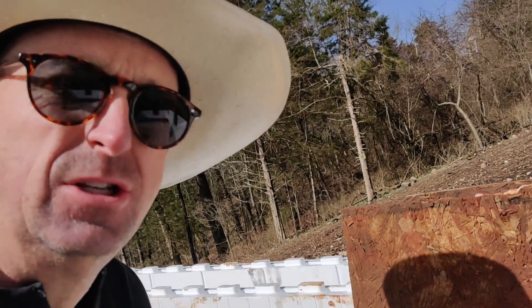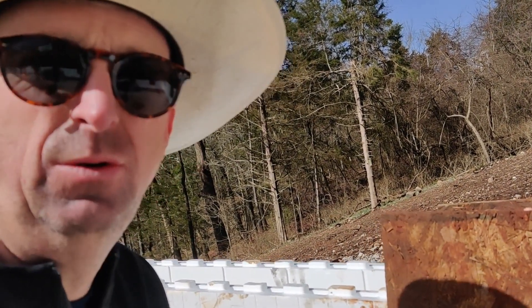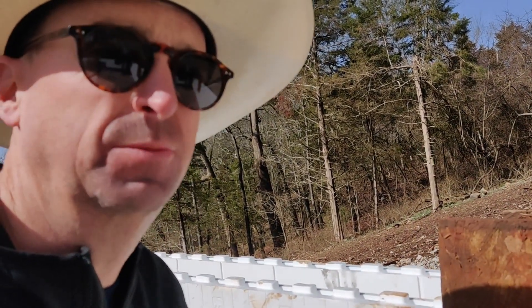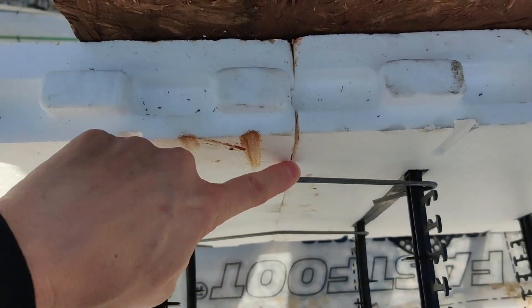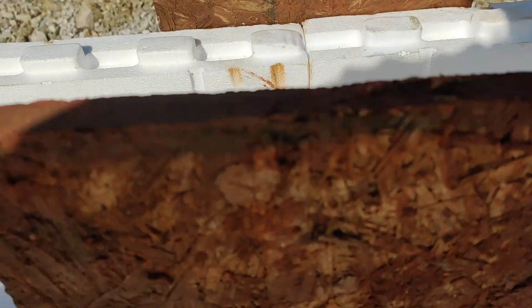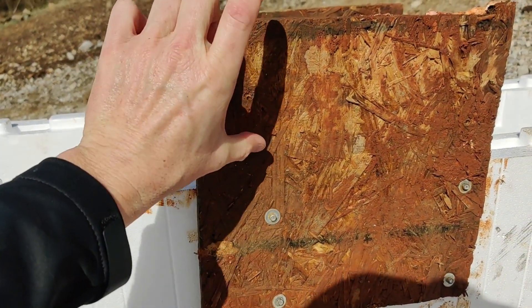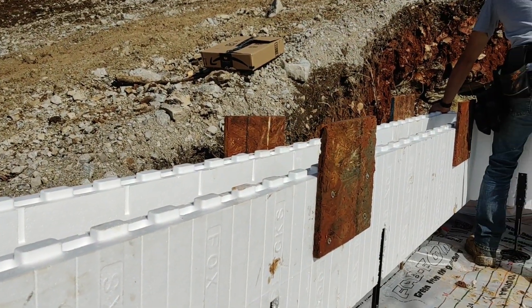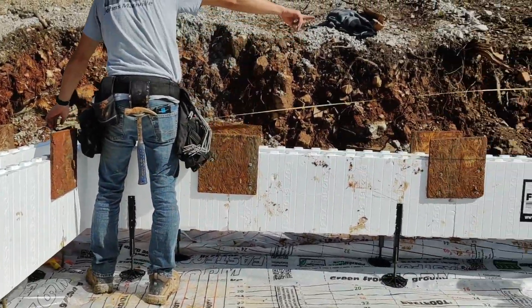You'll notice we're putting on these extra pieces of scrap wood — it's all by design. These guys add a little extra support all the way down at the bottom, because the amount of concrete and pressure is pretty great down here. We have this tie as well, but we also screw in this piece below and then the next block, so this whole connection stays tight as the concrete sets up. It's done on these lower pieces for each one as we go along, so the concrete doesn't have any ability to expand or push. The wall stays true, plumb, and straight.